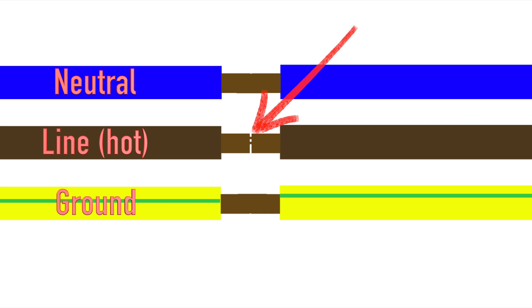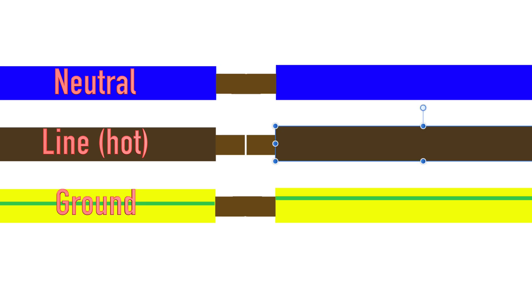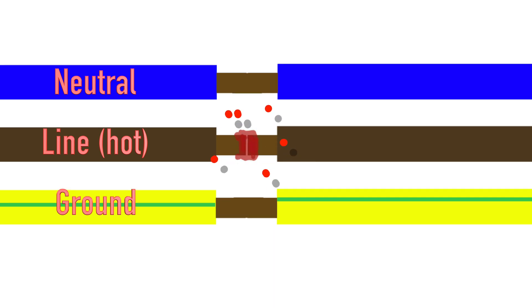In this slide, you can see only two strands of wire connecting the hot. What would happen if you started pulling current through this connection? It would heat up. And when a metal heats up, the resistance also increases, which causes more heat. Then the connection would melt, and the current would start to arc, continuing to heat up until it caused a fire — like in our case.